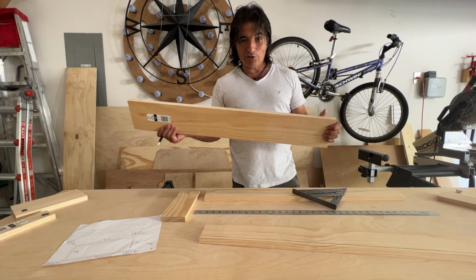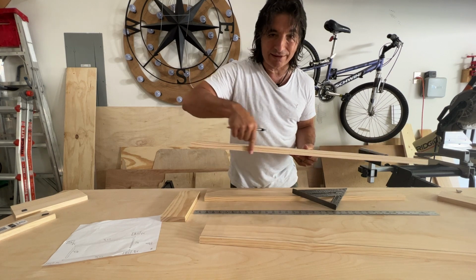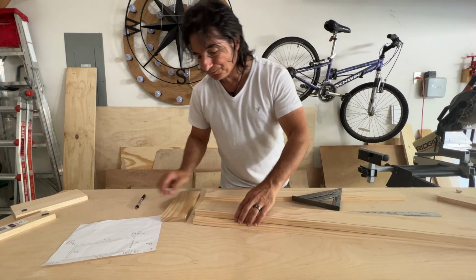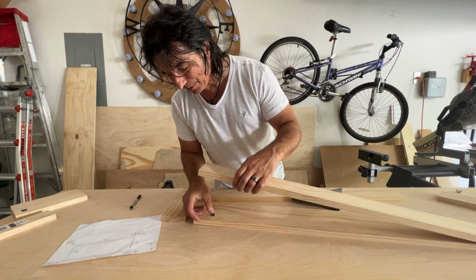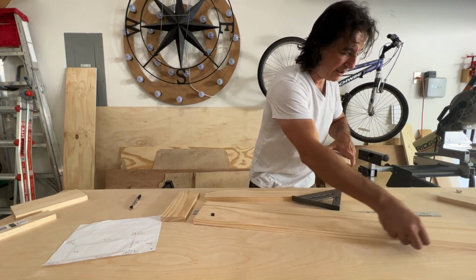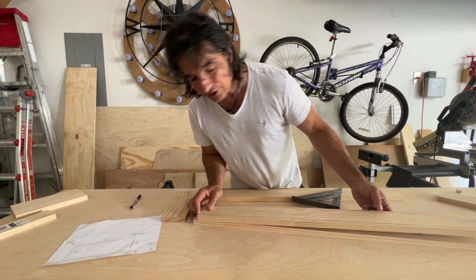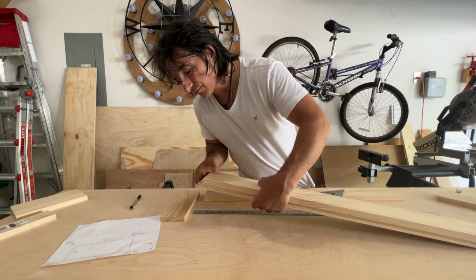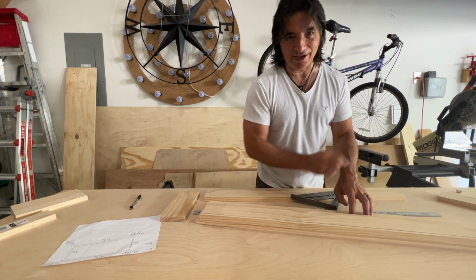I basically ran this piece of wood through the table saw, and then I left the blade exactly where it is. So now I know the blade basically rides against this edge of this scrap piece of wood. I'm going to take our good piece that we need to cut, and put a couple pieces of this little 3M double-sided sticky tape here. One there and one there. Now I'm going to line up these marks with the edge of this piece of wood. I should be able to run this whole piece right through the table saw, and it will just cut off the excess. Let's do it.